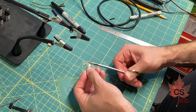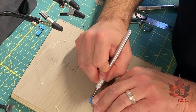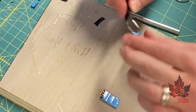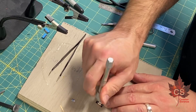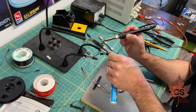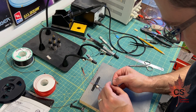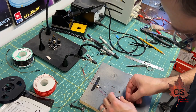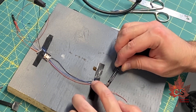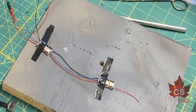Let's walk through the process of setting up these LEDs. I am removing the LED on either end of the strip - the terminals are just too small if you cut it down that line, so I need the extra space that removing the end LEDs affords me. We're going to cut and then peel back part of the adhesive backing to expose the terminals. Next, we're going to use a pin vise and create a very small hole just big enough for a tinned wire to fit through. This creates a physical connection with the LED strip, not just a soldered connection, and will be much stronger. The tinned wires are fed through that small hole, kept pointed up, and we add a little solder. Then we bend the end of the wire down and hit it again with a little heat from the soldering iron to create the final connection - and that is going to be super strong.